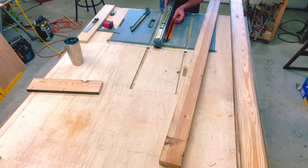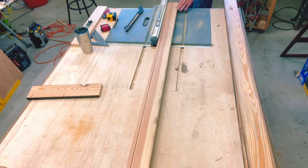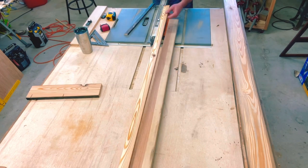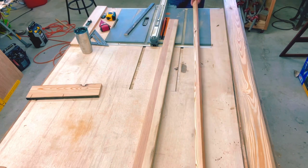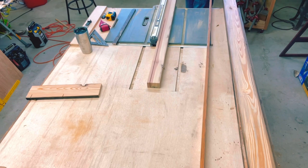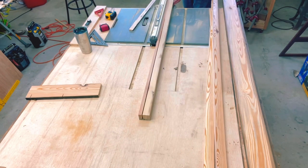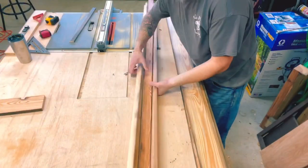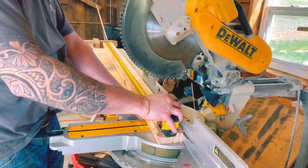I'm going to be using a couple of 2x4s to make this trellis. The actual strips for the trellis — I'm going to be putting five to make my fan. I've set my saw to 5/8 of an inch. You can also do this at 3/4 if you'd like — I've found that 5/8 thickness is plenty. The height of the trellis is up to you; I'm going to make mine six foot tall. I'm using eight foot material, so I have plenty of leftovers for the side slats as well. You'll need a total of six strips — the sixth one will be used to make your crossbars.